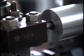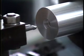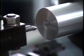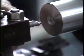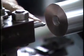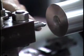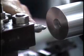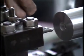The variations in feed rate that you can't avoid when you're feeding by hand produce variations in the cutting force on the tip of the tool. These tools are typically very long and thin, so those changes in cutting forces produce relatively large deflections in the tool, which then change the diameter of the hole.